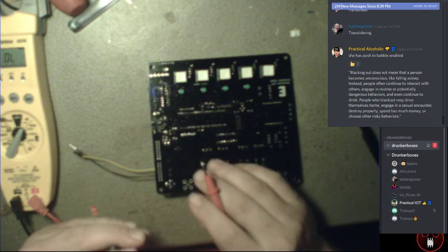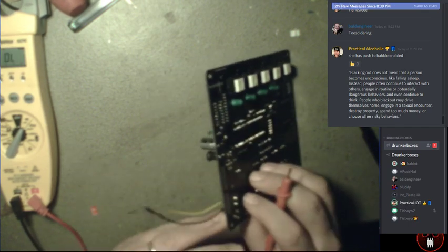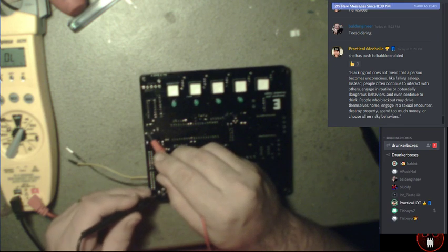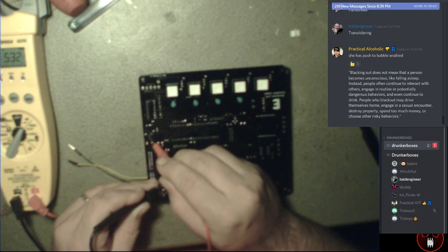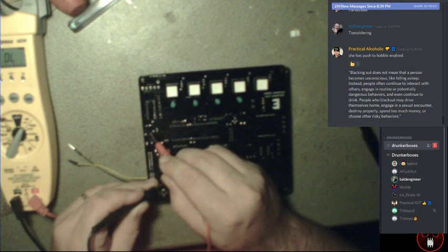That's true. They're very narrow banded, so small frequency changes really move the resonance around much more dramatically than they do at higher frequencies. Okay, so at these ham frequencies, are your antennas and transmission lines, is their characteristic impedance 50 ohms or 75? 50. Okay.